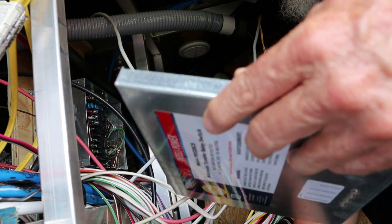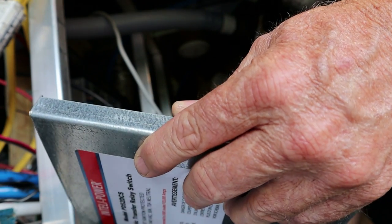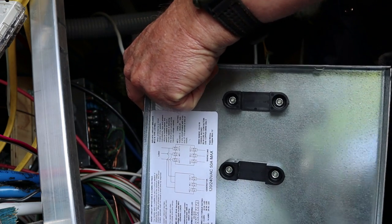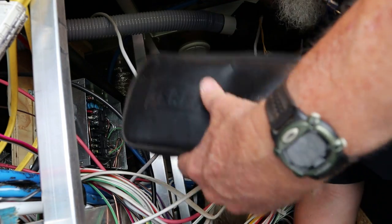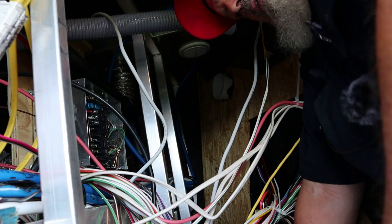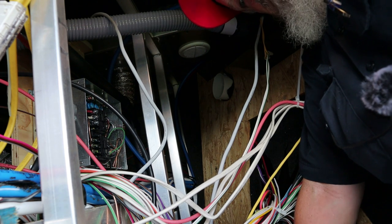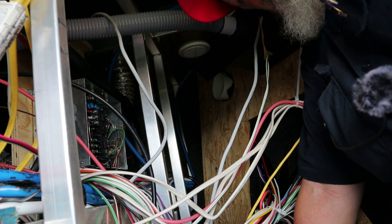So the orange one is the generator, that one is the shore cord, and that one is the load. This lid has a legend — it tells you which one's the generator, which one's the shore cord, which one's the load, which load goes up to the power distribution panel. I've got my meter out. We have the camper unplugged, but we're just going to make sure 100% that we have no power in here. This camper does have an inverter, and there should not be any power in here from the inverter, but it just does not hurt to check.